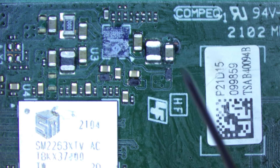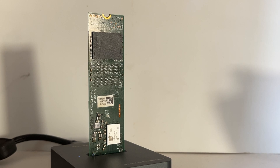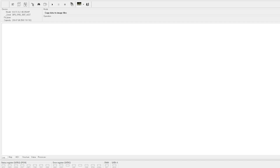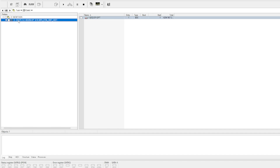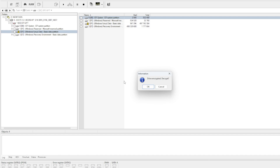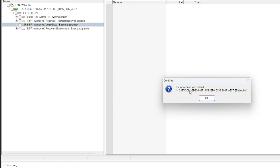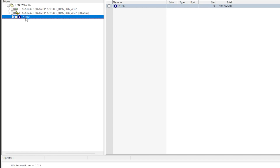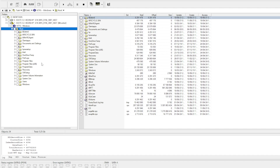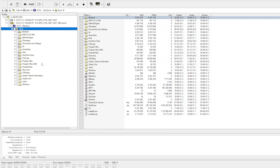The short was probably draining all the energy, so the controller couldn't power up. I'm feeling confident this is going to work. We're getting a full ID from the SSD — good news! We've got a partition table with a Windows NTFS volume with BitLocker, so we need to decrypt it. The user has given me the key, and there it is — we have successfully fixed this SSD and got access to all the user data again. If you need our mail-in data recovery service, I'll leave a link in the description. See you in the next video.